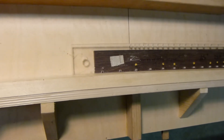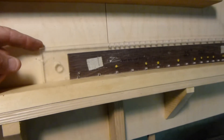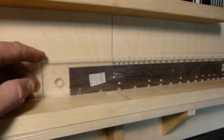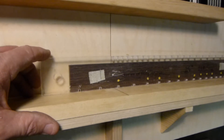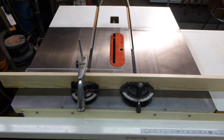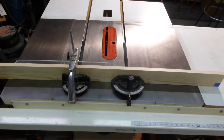Because the pin is located too low for thick necks, I can make another auxiliary fence with a higher pin — move it up that way. I have a lot more versatility with this jig. I like to use the quarter-inch plexiglass because you have quite a bit of room to move up and down for various thicknesses. I've done things as thin as a yardstick and you could go almost three-quarters of an inch thick without having to move the auxiliary fence.